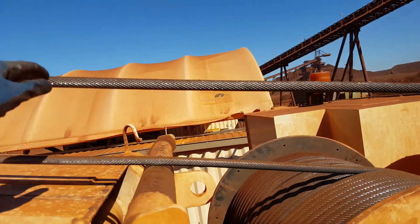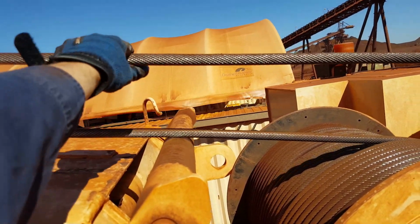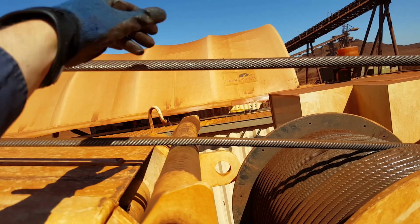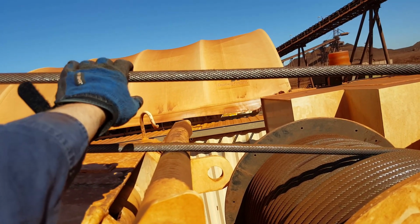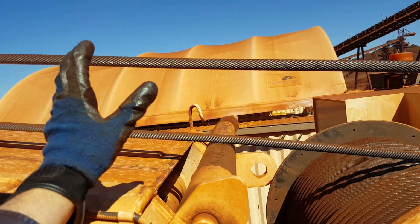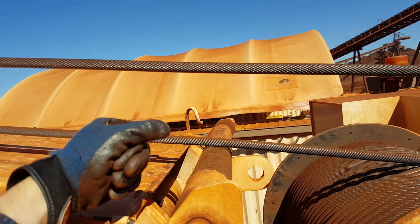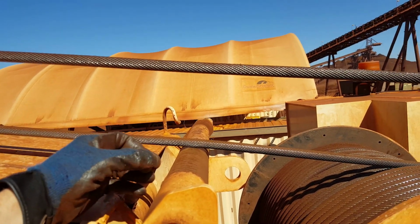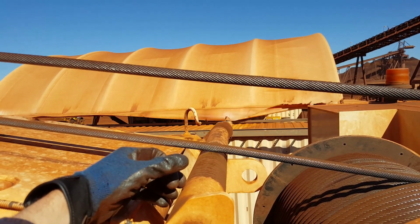So if you're doing a heavy lift, obviously you have heavy chains on it, so that will make this tighter. Then you've got heavy lifting gear, spreader bars, so they'll make it tighter. Alright? But the same thing with slew cranes. As soon as you've finished doing your heavy lift, we need to bring it back to 4 falls. Alright? Now sometimes that's not the right amount, but I'll talk about it soon, okay?